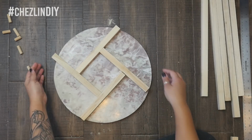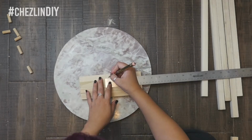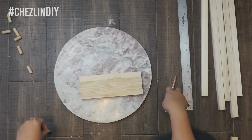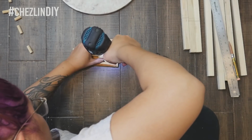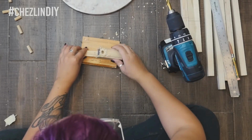Once I determined that everything was correct, I stacked them together again and then marked the midpoint of the marks like so. Then I used the jig that I made to drill the holes. I simply lined up the mid mark to the hole and then drilled. My aim was to go about ½ an inch into the side of the wood dowel.